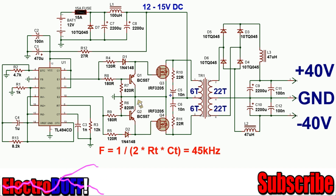When it turns off, transistor Q2 will turn on, ensuring that the gate of the MOSFET will be discharged very fast. For the transformer, ensure that you get a ferrite core transformer or one with an iron powder core, and the windings are shown. You need 6 turns on each side of the primary winding and about 22 turns on each side of the secondary winding. The center tap will go to ground and the bridge rectifier should have a capacity of at least 10 amperes.